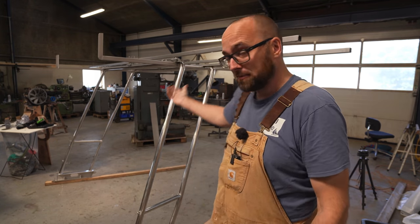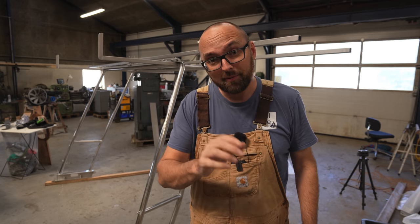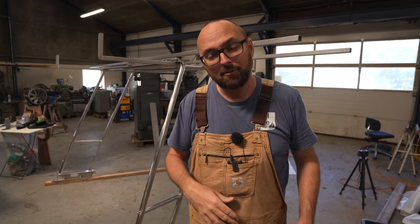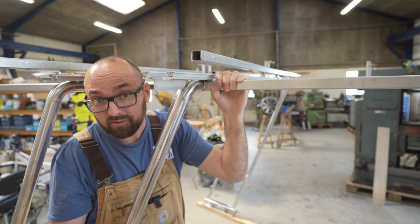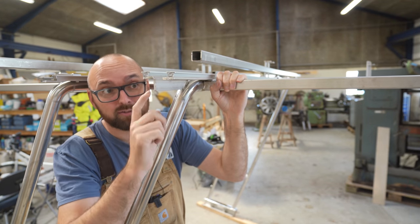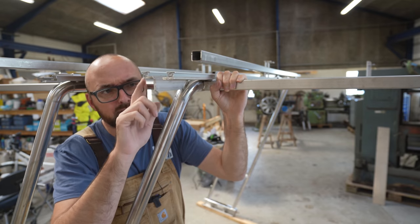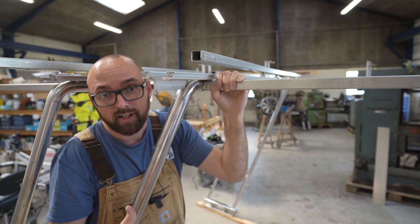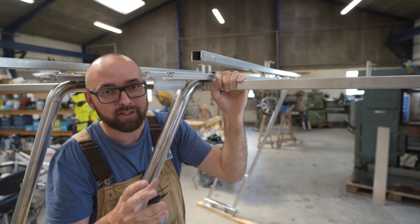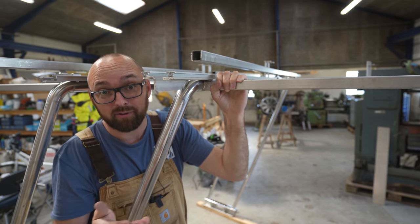With this monstrosity we'll be able to carry just over 1200 watts worth of solar, which is a lot for a 38-foot boat. We won't be able to sail with these panels extended, but that's okay — they're more so used when anchoring. The nuts and bolts to secure the aluminum track to the stainless arch are supposed to arrive tomorrow. We also need to devise some way of separating the aluminum from the stainless to avoid corrosion, and then hopefully on Saturday we can convince Martin and Karina — the cement boat people — to lend us a hand getting this thing mounted on Athena.